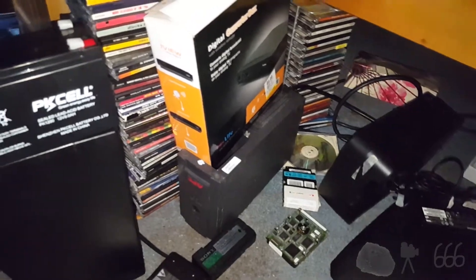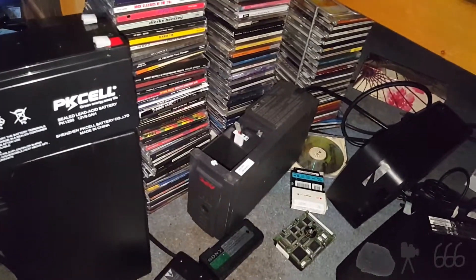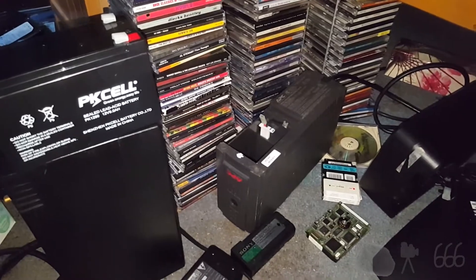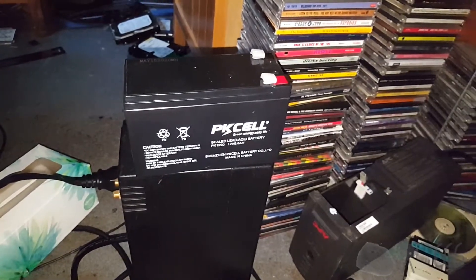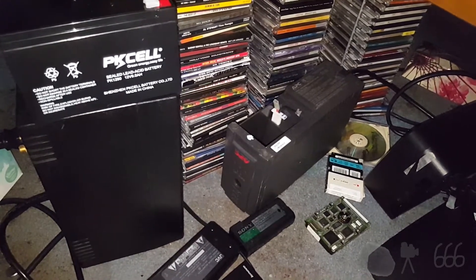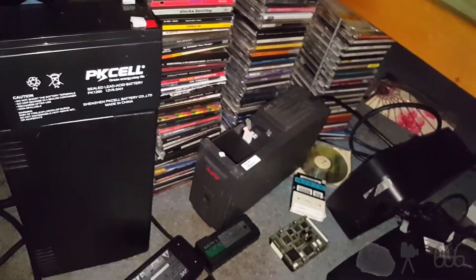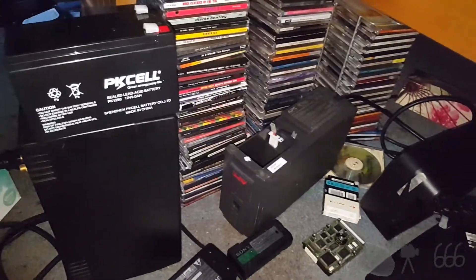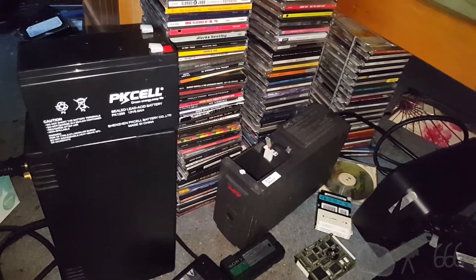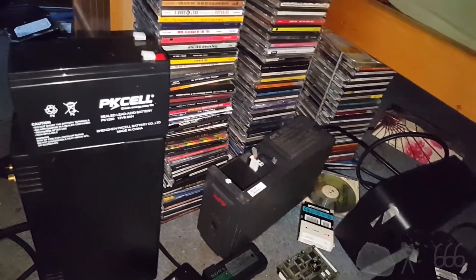So now that it's been a little while, I did go ahead and finally get the replacement battery for that UPS. Actually I should correct that by saying it's still not the right battery - this was a job and a half, and I complained to them that they still gave me the wrong battery. It's got the right terminals, it's a 12-volt sealed lead acid battery, so hopefully the charger will work with a significantly larger capacity. We're going from a 7.5 amp-hour to a 9 amp-hour battery, so it's probably not really that big of a deal. And honestly, since they gave me a bigger battery, I'm not going to complain anyway. But it does mean I have to actually put it in the UPS and see if it actually still works.